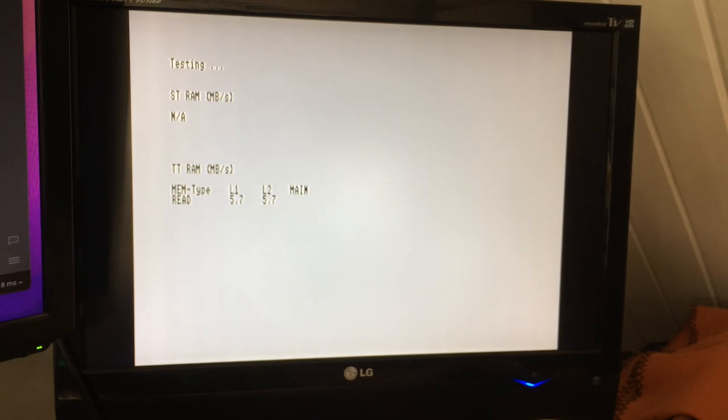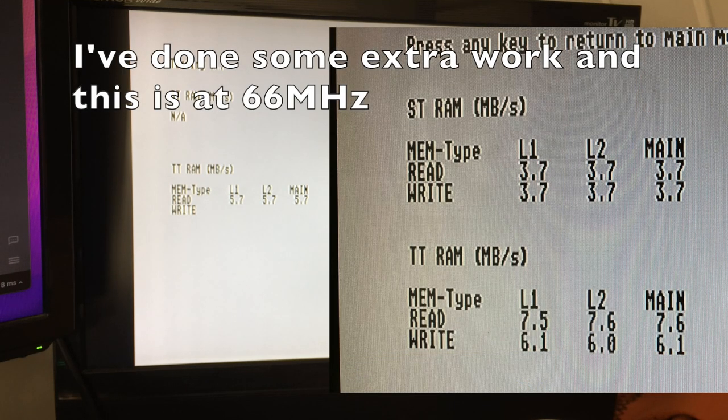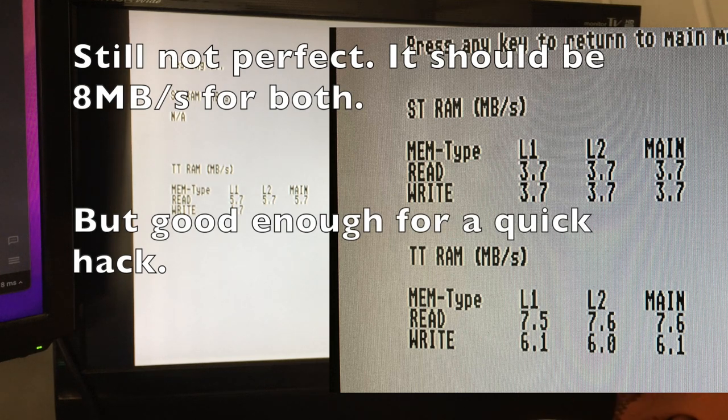32 megahertz oscillator, which is not the optimum. Ideally, you want to be at 66. Divide down some more. So it's a 32 megahertz oscillator, halving its clock for 16 megahertz for the CPU, driving the RAM at 32. And then we obviously step down to 8 megahertz when we're talking to the system board. So the performance benefits that we see from here are mostly when we are talking to alt RAM, of course.